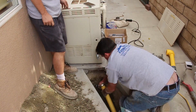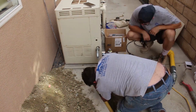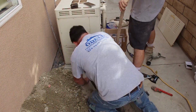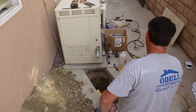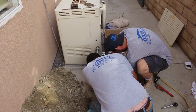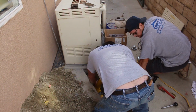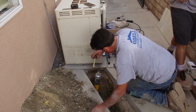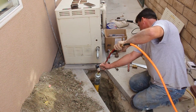So the nice thing about having the epoxy coated steel fittings here, that are going to go partially below grade, is I won't have to wrap those with the 10 mil poly tape, and I won't have to use a primer because it's already a done deal. Now you could use a standard black pipe through this whole thing if you wanted to, but then you've got to prime all the pipes, you've got to put the 10 mil on it, a lot more steps. And even after you do all that, it's still not as good as the poly.